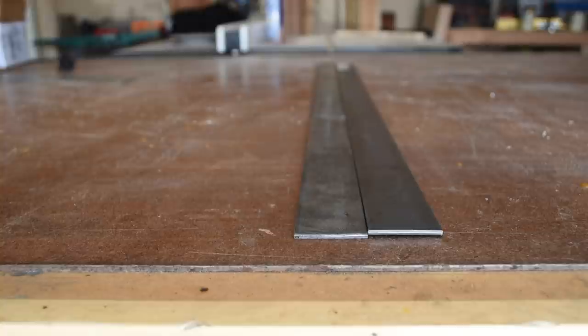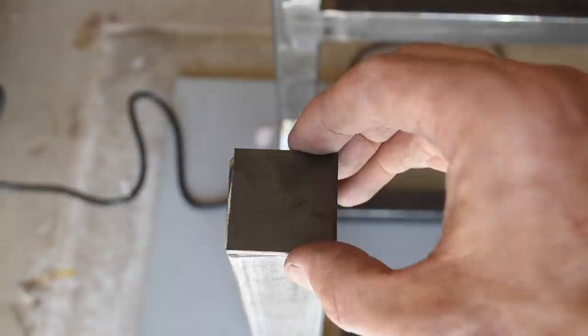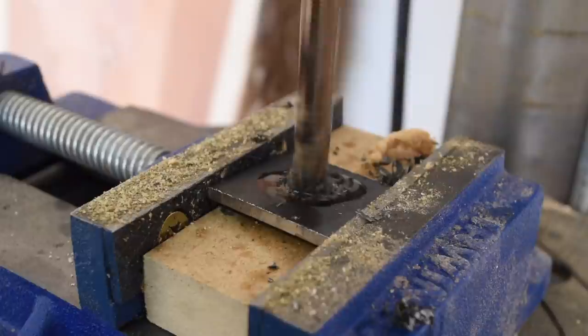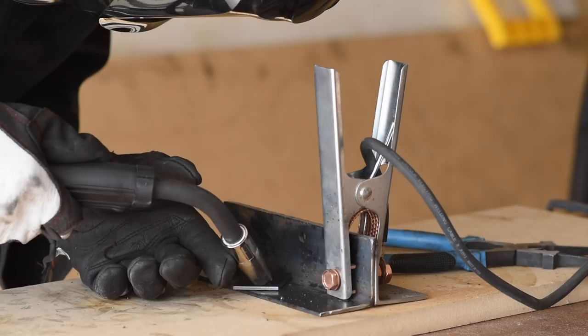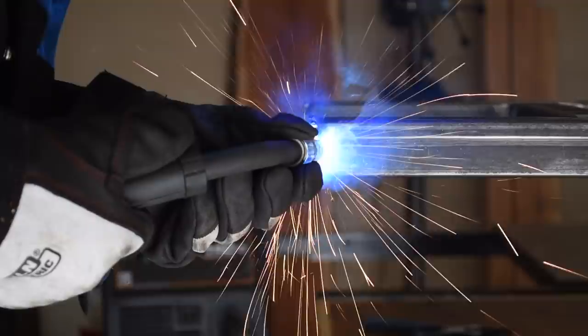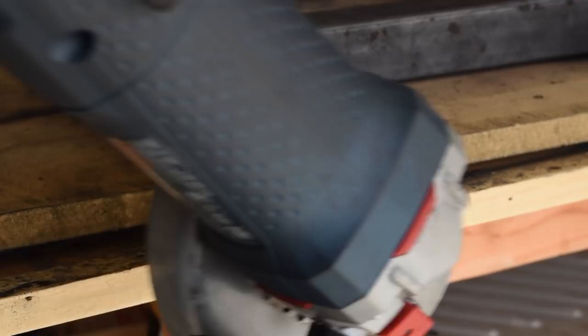I had to make some adjustable feet for these stools, so I used 1.5 inch flat stock steel and cut it to 1.5 inch square — 12 of these for the adjustable feet and 12 more for the attachment tabs for the seat. I drilled out a hole for each one on the drill press. Then came the tricky part: lining up a 5/16ths nut over that hole so I could thread in the adjustable foot. I messed up more of these than I'd care to admit, but I did end up with 12 good ones. I ran a bead of weld all the way around each adjustable foot and the attachment tabs, finished up with a flap disc to clean up the welds, and tested out one of the adjustable feet — it worked great.